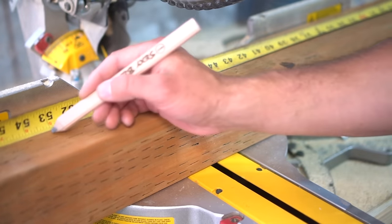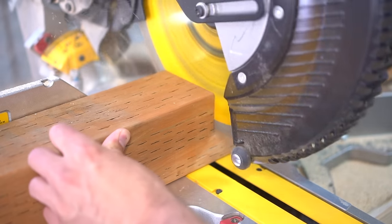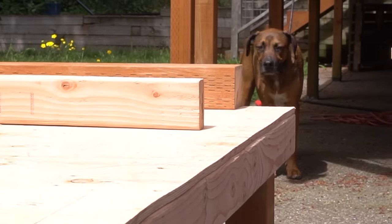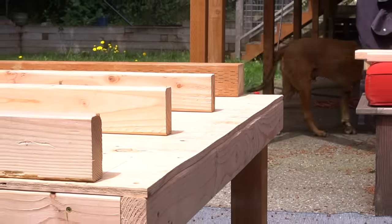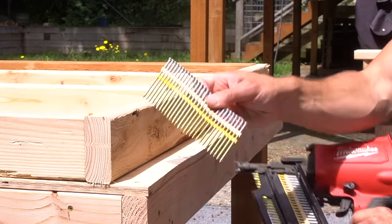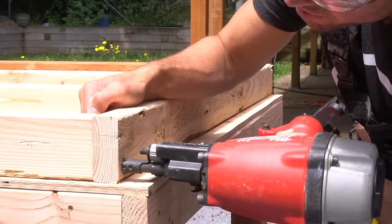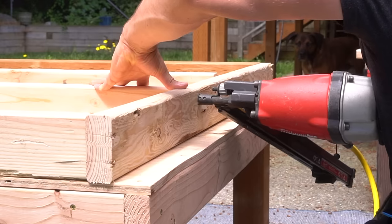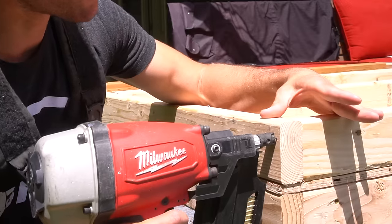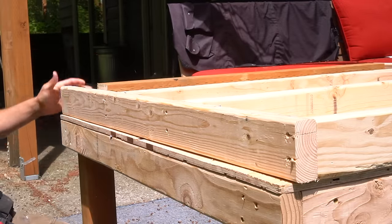I did want to beef up the opening of our structure, which is why I'm using a 4x4 post at that location, but I also have to accommodate for the header, which is why I'm cutting it short. In order to build a properly secured wall, I cut a base plate as well as a top cap at 48 inches and secured them with my framing nailer. These nails are three inches long and can go sideways when they hit, so make sure you have proper hand position. I noted this specifically because watching this video I realized my hand was precariously close to the nailer — if one of those nails jetted out at the wrong direction, I could have easily gone through my finger.